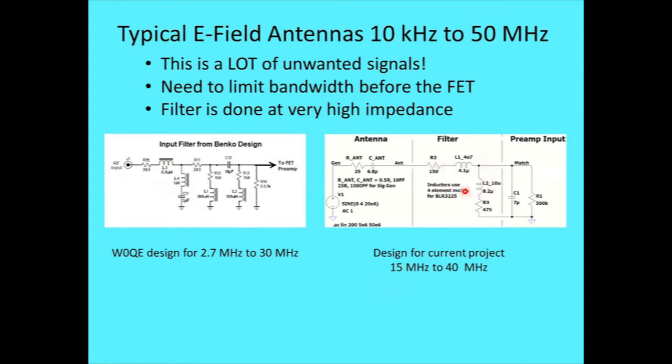And it worked out. And that inductor, I've got two values on it there, because this is also a SPICE input file that I just took and cut them out and used those for pictures, because a lot of times it's easier. But notice I'm at 4.1 microhenries, and the coil I mark is a 4.7. That's because the parasitics in the coil cause it to be a 4.1 plus a lot of parasitics, which don't show on the screen there. But anyway, that's a 4.7, and this one's a 10 microhenry coil with the resistors there, which add a little bit of noise, but not that much.